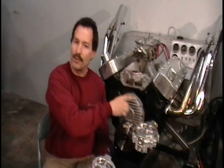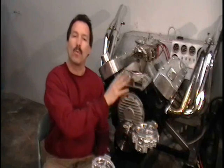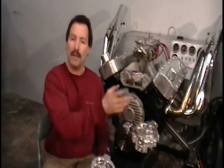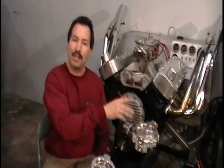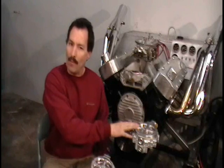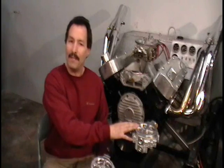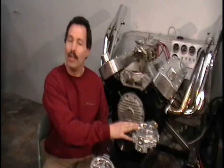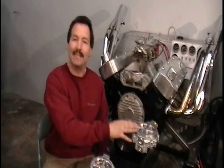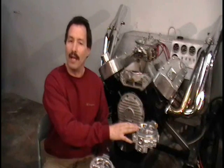As soon as the motor fires, it will start pumping oil through the filter assembly. Then we're going to shut the engine off, drain the filter assembly, and show you how quickly it can be drained and a visual inspection done. We'll refire the motor to show the fluid going through it again and do it one more time. We're going to do this twice to show how easy it is to check the filter element when the motor is shut off. You could do it in seconds after you come back from the pits of a drag race, or even at a pit stop if you have a circle track car. You could pull in, shut your engine off, have a crew member pop the hood, put a little air pressure to the filter, and in seconds know if the motor is okay and send you back out.